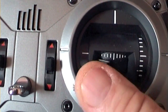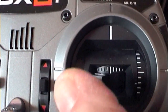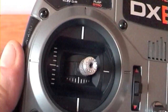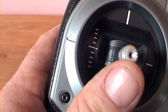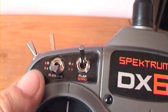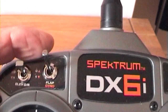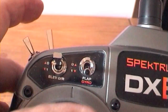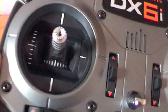Do the same on this side — that will set all your lowest positions. Make sure that one is absolute zero. Switch off your elevator switch — simple as that. Then you use the draw switch to program it: switch it on and then switch it off. That sets your upper limits.